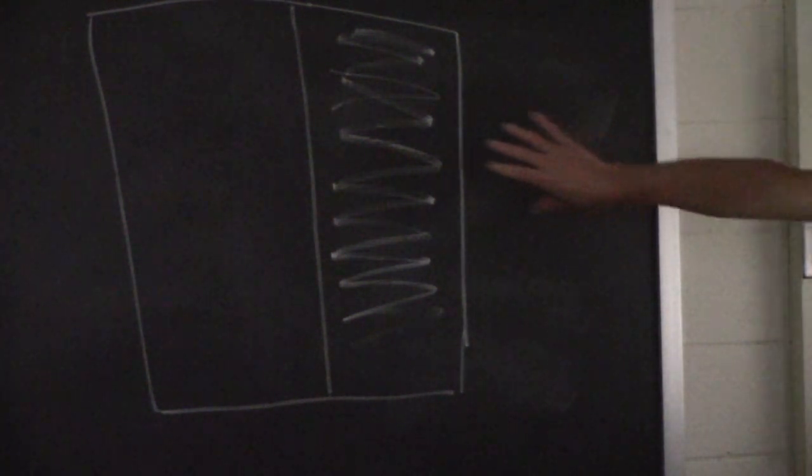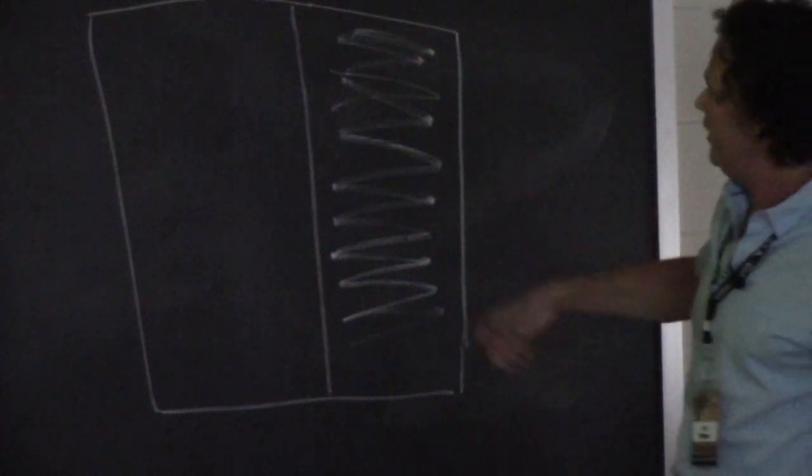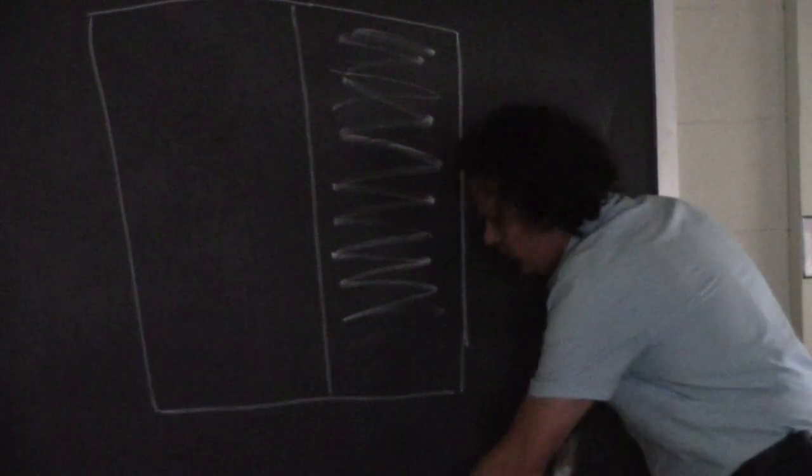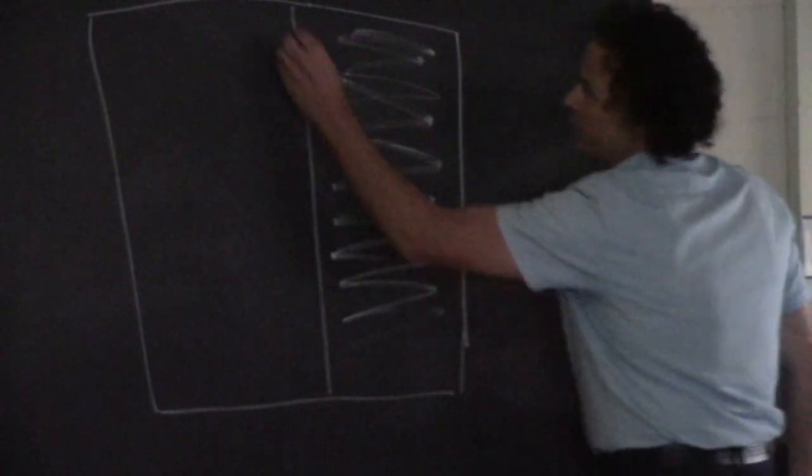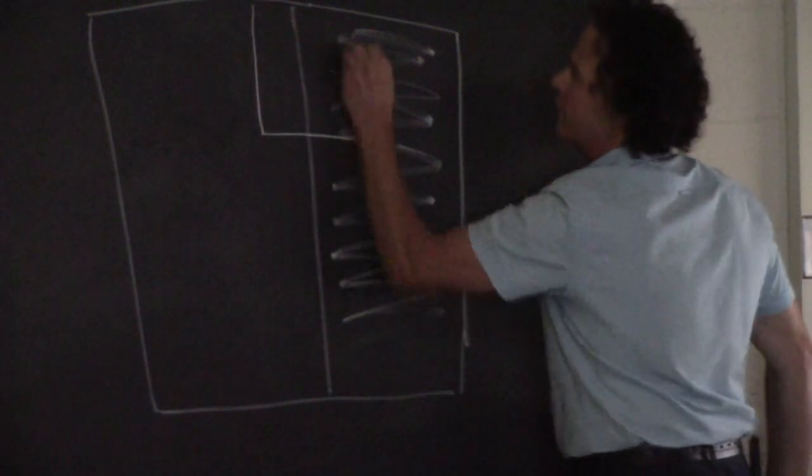If we were to take this piece of spruce and flip it, now you're going to see that the grain runout goes to the other side. It's just a matter of which way the light is catching the grain runout and creating a shadow. So if I'm looking at a top and I see grain runout like this, and let's say, for example, here's my fingerboard extension.